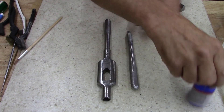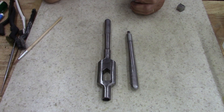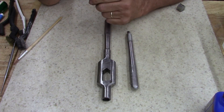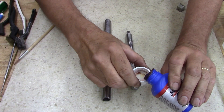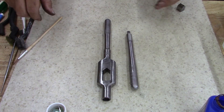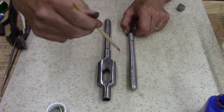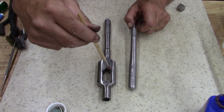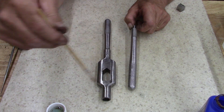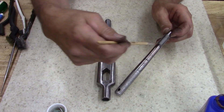All right guys, I really don't know how this video is going to turn out, but I'm going with it anyways. I put it on the 1x30 fiber belt, and my plan is I put some blueing in the cap — I'll dump it out to keep it from cross-contaminating. I've got to blue it and then rinse it, but I'm thinking this is not going to take very well because there's a slight gap around there and I think water is going to get in around that. But let's see what the blueing looks like.